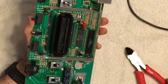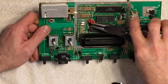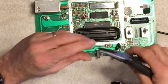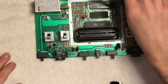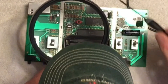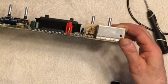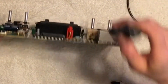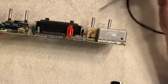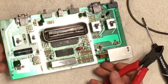I suppose I can just break it off — I don't see why not. Okay so there's the transistor I had to remove. This kind of broke out pretty easily. Put that aside, make sure the leads aren't touching anything else. Next I need to remove these pins here and cut them, because this circuit board here is no longer needed — so that's going to be taken out of the loop. So I'm going to cut these pins with my cutters here.